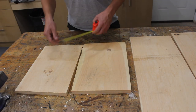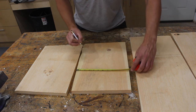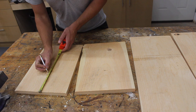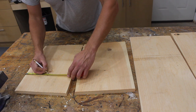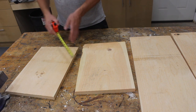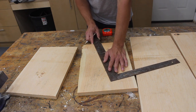These two pieces are the legs and we're going to cut a V out of them. I'm going to go five and five-eighths down, making a mark roughly in the middle — five and five-eighths from the end, since my boards are 11 and a quarter inches wide, that's roughly the middle. I want to keep it looking fat at the bottom, so we'll do about three inches on each end and connect those tick marks.